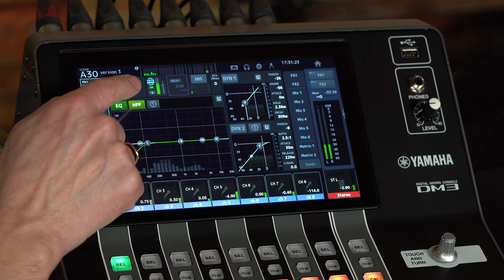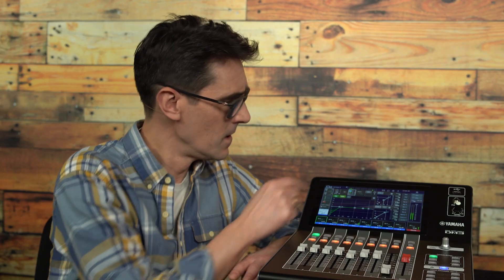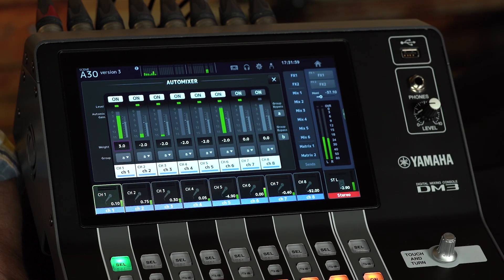Now let's return to the Auto Mixer. This is fixed for input channels 1 to 8, and you can see the Auto Mixer status on the selected channel above the EQ, next to the Delay. For those unfamiliar with what an Auto Mixer is or what it does: it operates on the input channels in a post-fader position and regulates the level of each channel reaching the main stereo bus. Whenever there are two or more microphones used for speech, such as a panel discussion, a chat show, or theatrical drama, it automatically reduces the gain of a channel when the mic is idle and increases it when speech is detected.